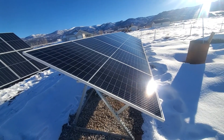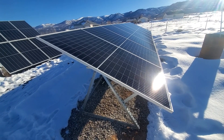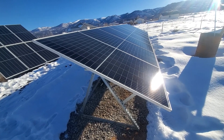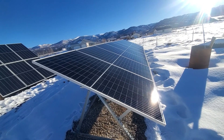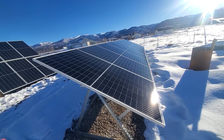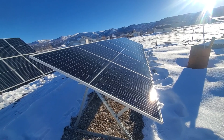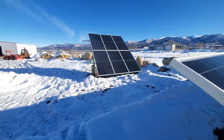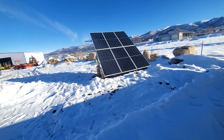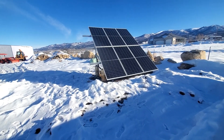As far as costs go, this is about $250 of material with the Unistrut for eight panels in series — eight times 400 watts is 3.2 kilowatts just on this array — and it cost us $250 to make this frame. That's a commercial frame over there, about $300 to $400 for a frame that holds four panels, which we jimmied to make it six panels.